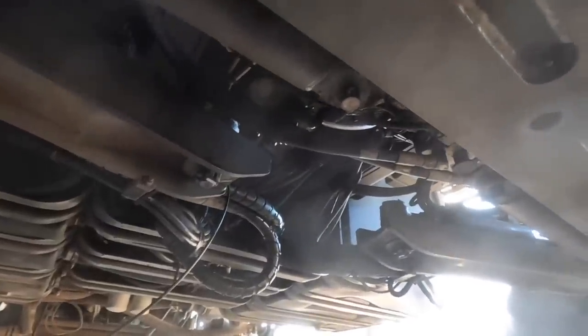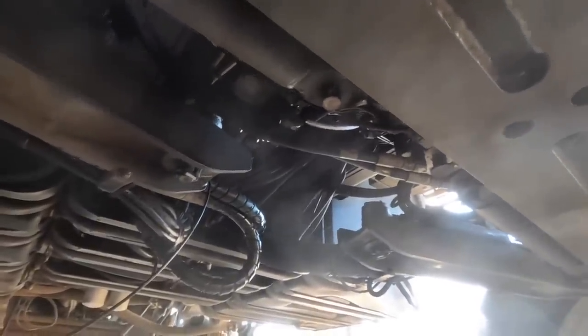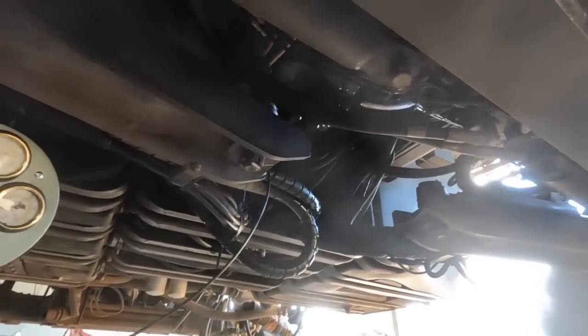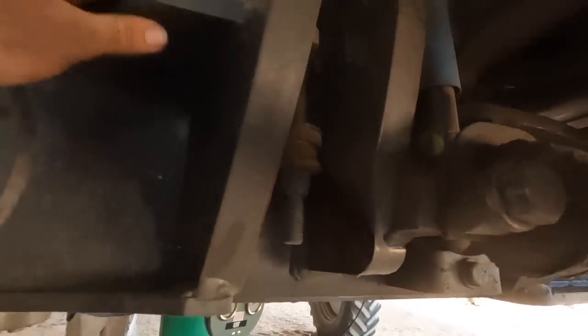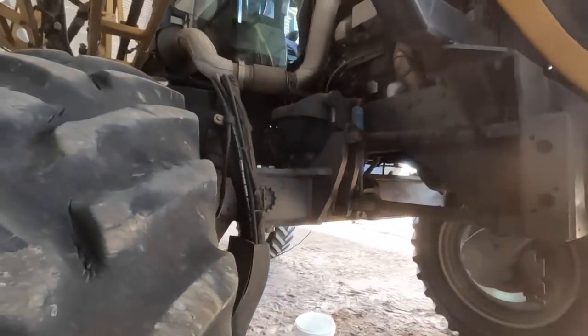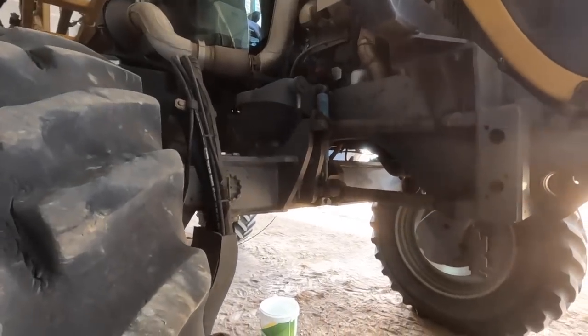There's one on each hydro. Check them for anything. And then we will try and suss out whether there's metal in anywhere, or go from there, I guess. It's due for a service anyway, so we'd be replacing the hydraulic oil. But we need to find out why it's doing what it's doing.